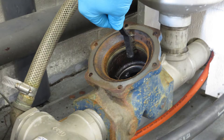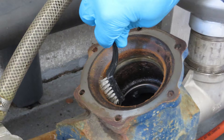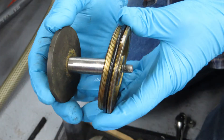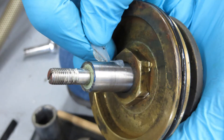This next step is really important. Use a wire brush to clean the threads of the nut plate and the valve body where it threads in — you won't have to worry about cross-threading that bronze into the cast iron. When you're done cleaning those threads, clean them some more. You only have one chance to put it in right. Now with a rotating motion slowly work the plunger shaft through the hole in the nut plate, being careful not to have the sharp edge of the shaft damage the o-ring. Usually if you put it in at a slight angle and walk it around it goes in nice and smooth. When it's in, it should ride in and out of the hole smoothly with no restrictions. Re-lubricate the shaft one more time.